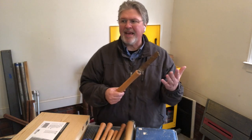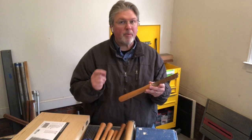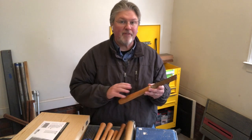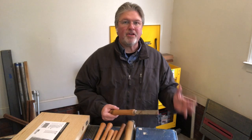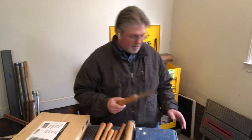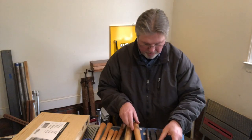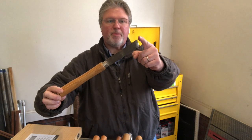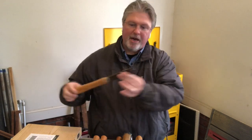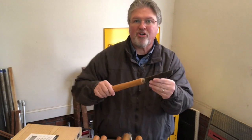Unfortunately in today's day and age, for what they are, they're a little bit expensive because they're just carbon steel. Carbon steel will take a very sharp edge — you can get a super sharp edge on these — but then that edge goes away very fast. So what they are good for is getting a number of shapes into your hands that you can play with and practice sharpening with. I've got a couple here that over the years I've reground for different purposes. For example, when my son was learning to turn, he was having a problem catching the top part of the skew. When turning spindles smoothly or cutting a bead, we're not using that top half, and if we do it tips forward and gets caught. So to prevent that, I just ground that part away on this skew for him.